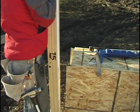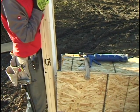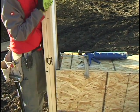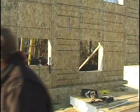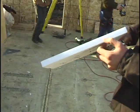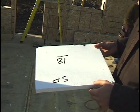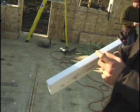To the extent of the research we've done, we think this is the very first passive house built in Ohio. The walls are 14 inches thick and made out of what they call 2-pound density EPS — expanded polystyrene foam. The R-value of a 14-inch wall at 2-pound EPS is roughly about 60, so the walls are going to be an R60.